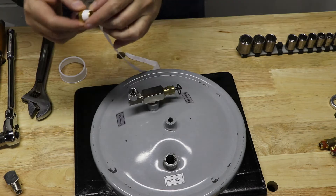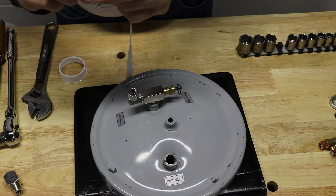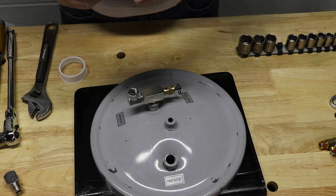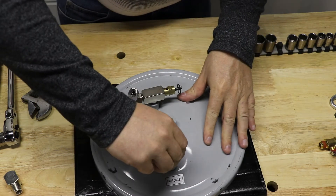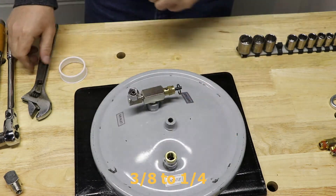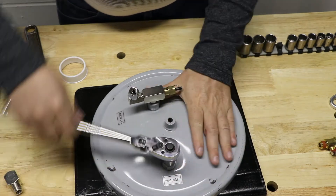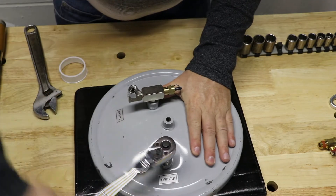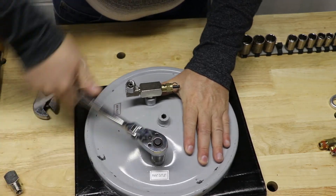This was too big to fit directly to the adapter fittings I had, so in order to put the T-adapter in we had to put in a thread reducer. I'll include a description below — I believe it was three-eighths down to one-quarter. As usual, just standard connections with pipe thread tape to keep it from leaking, and tighten down with the wrench.